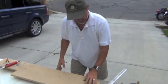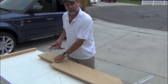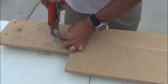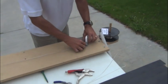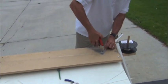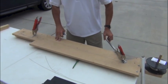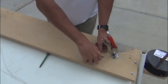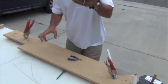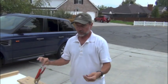What I built is this straightener. What we do is we actually stretch the wire about an inch and a half over three feet in order to strengthen it and also to straighten it. You'll be able to see in a second that it's very straight. Let's give it about half an inch or so per foot. Voila — it's very straight now. It's straight enough that we can correct the last little bit of bend when we do the soldering.